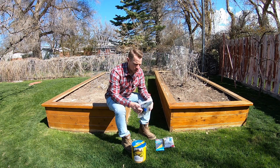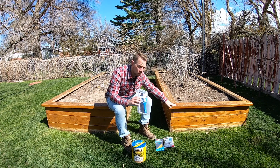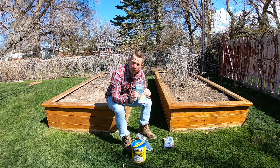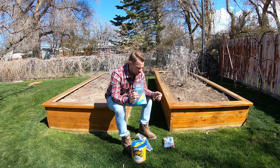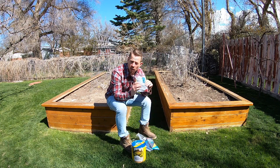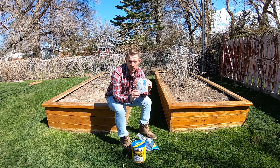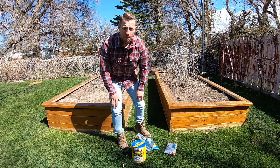A few of the tools we're going to use: a small paint tray and a small roller. I like the heavier nap rollers because it gets into the wood a little bit better. I'm going to sand them down with 120 grit — 80 is a little too rough and 220 is obviously way too fine, so 120 will be just fine. You're also going to want some rubber gloves when you're staining; it is messy, sticky, and nasty. Let's get started.